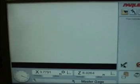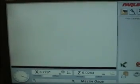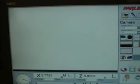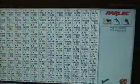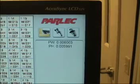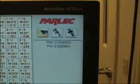Repeat this process through all the steps on the vision screen. After all the steps are completed, a pop-up on the control unit will ask the end user to verify the pixel calibration results. Press the OK button, then press the Save Pixel Calibration button.